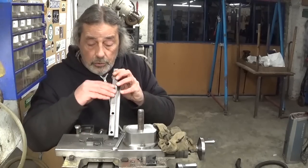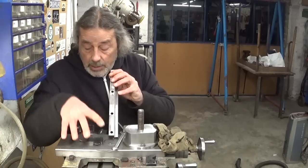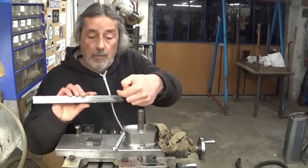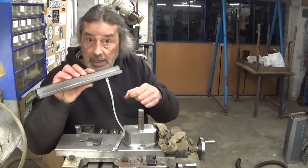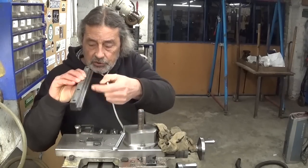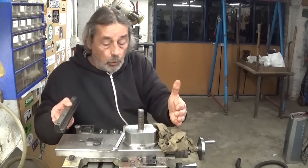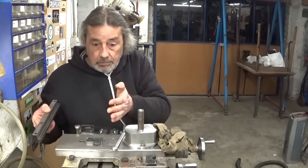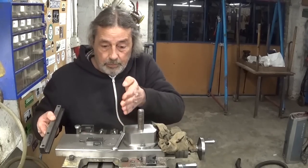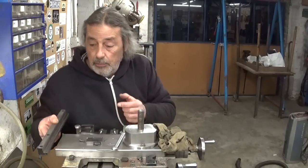Let's take the thing apart and see what we can do about it. I just took off the other side clamp system here — that comes below and holds the carriage down on the other rail with this surface here. And I see that this surface is nice and shiny, which means this surface was rubbing on the side of the bed, pulling the whole carriage this way. It's not supposed to do this — it's the reversed V that keeps the carriage in place, not this one. This one only prevents it from lifting.